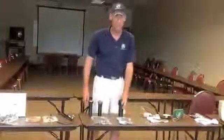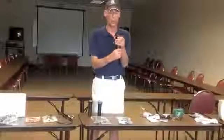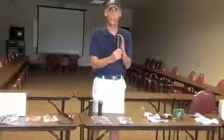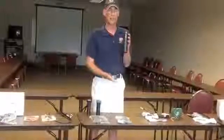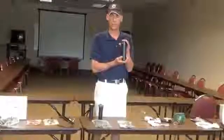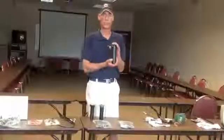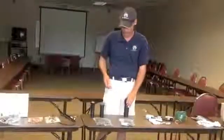The same type of pressure regulation is available in gear drive sprinkler heads now also. This product is regulated to 50 psi within the head. So even if you have 70 pounds of pressure coming into the bottom of this head, coming out you'll only have 50. This decreases misting, which is a huge waste of water — probably more waste than we could possibly know.